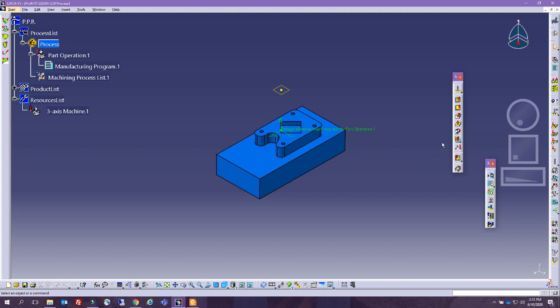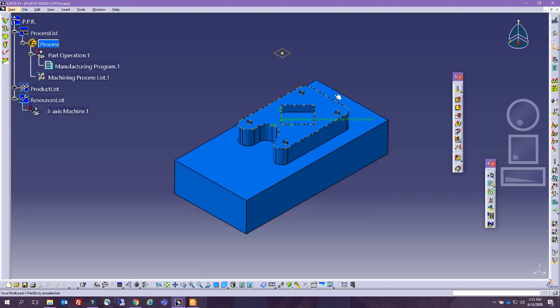So as I said, there are multiple ways to do this. You have to start thinking of it. If you remember, we had 3 millimeters that we wanted to remove by surfacing, but you don't really need to remove them by surfacing and then do something else. So there is this function called prismatic roughing. I like this function because it moves you from the roughing stage to the finishing stage. It will take the axis along Z or however you define it, and try to remove as much material as possible. So let's go ahead and try it out.